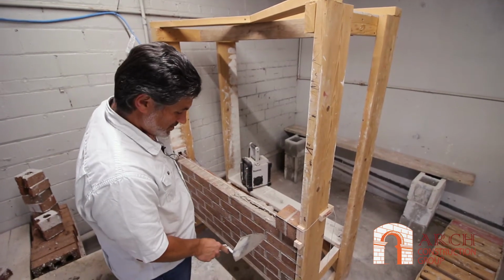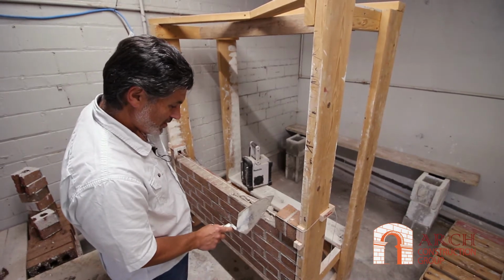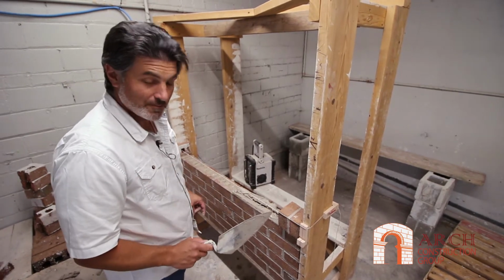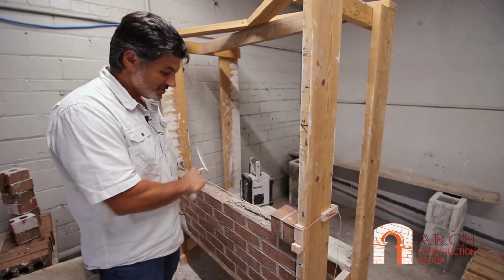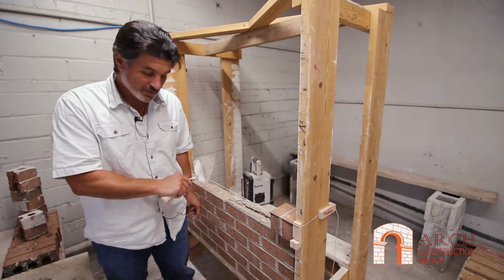Every brick for modular brick is 3 Rowlock. So you can simply, especially if you have a big run, just follow your joints and make sure that you're on scale. If it's an odd size window, you might want to scale it out and put pencil marks and follow the pencil marks so that you close good. Always be thinking 2 moves in front of yourself.